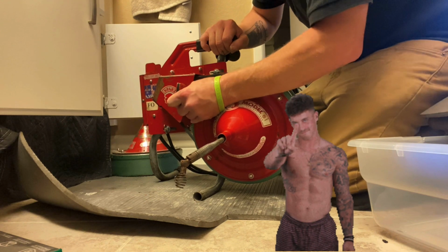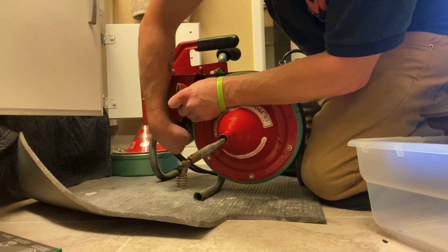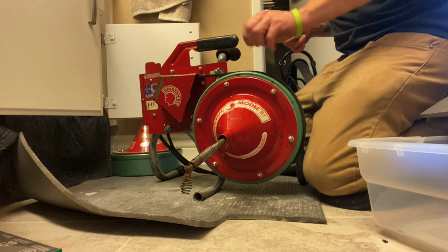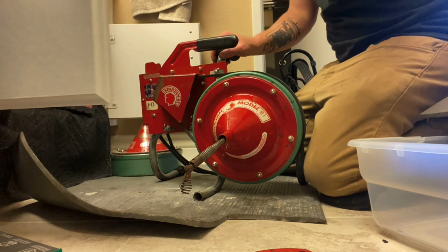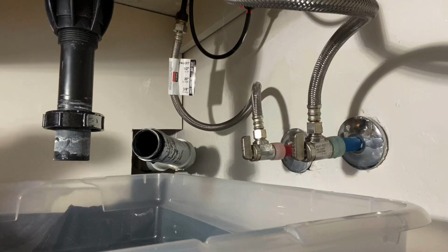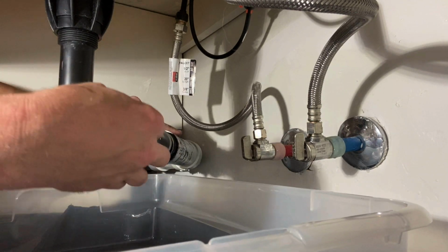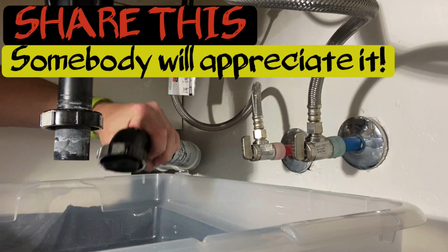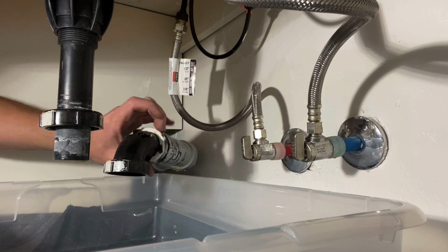Whoa, look at the tip on that thing. That's a thick tip right there. I can't remember if it's a quarter of an inch or half inch thick. I'm gonna have to look at it tomorrow. But yeah, that's a thick tip for that 5/16 cable. That's what really helps with the Spartan cables, helps push stuff down the line, helps give that cable some weight, helps it drop down lines, helps it when it's binding up. It creates more torque, I believe, because that head is so thick. It helps the little wire kind of bind up and get that torque going.